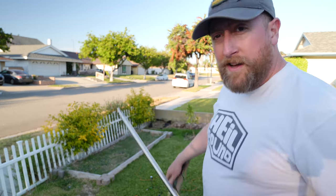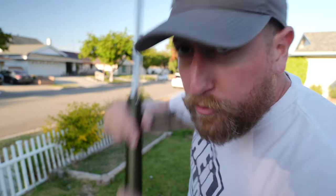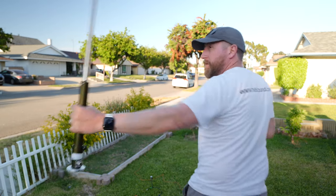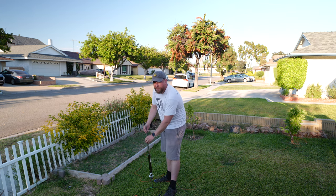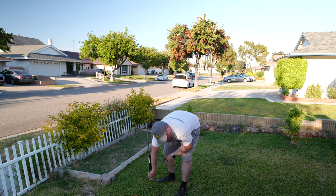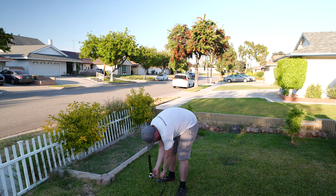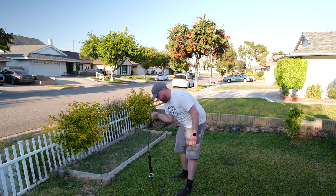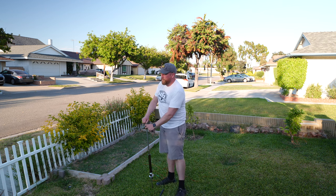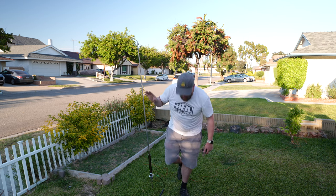Let me show you how to get those all tuned up right now. I have my stake in the ground — I've pushed it into place, maybe use a plastic mallet to do that safely. You don't want to screw this in and then push down with the coil — you'll damage it. So my coil has the vertical attached to it. I'm simply going to drop it in, let those threads kick in, and when we lock in the whole thing turns. Plug in your coax. I have two pre-cut 16.5-foot radials bundled together. I'm going to extend the whip. Coil is all the way closed.